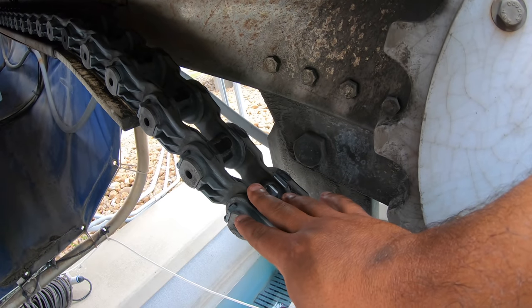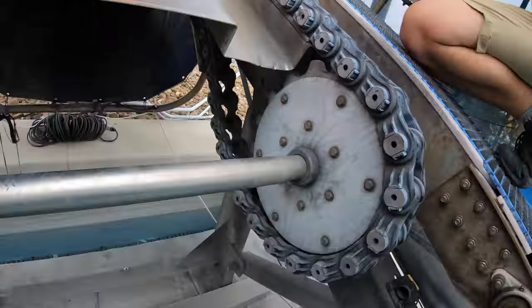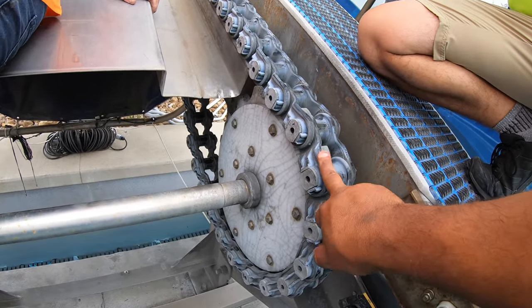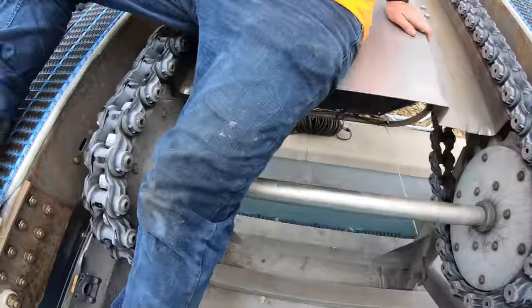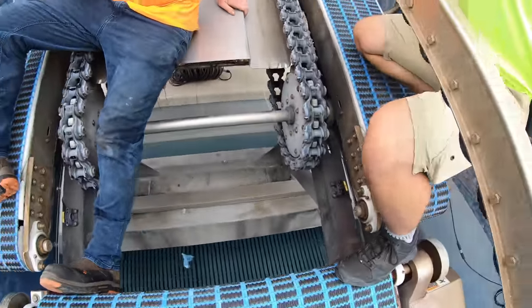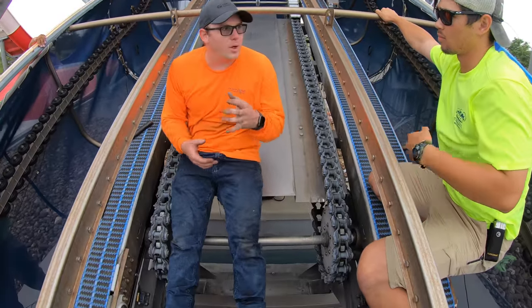You have too much sag, okay? You can just take a cleat out. Or a half inch lower than that, and then you'll be like, all right, one cleat. Right. You can take a link out. But whatever you do to one side, you've gotta do the other side. Okay. And you also want to keep track between which cleats you're doing it. Correct. Yeah. So if we do it this time, it's between cleats 2 and 3. Yeah. The next time you want to go between 3 and 4.